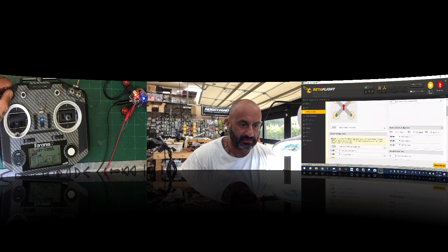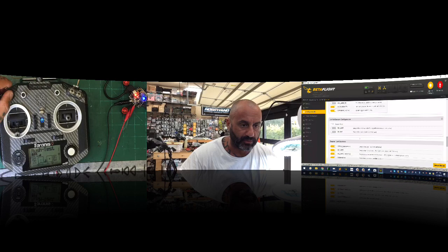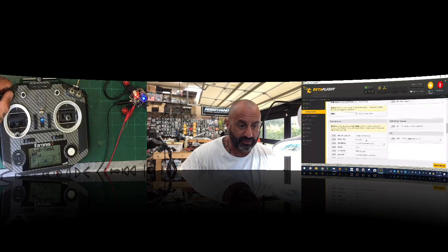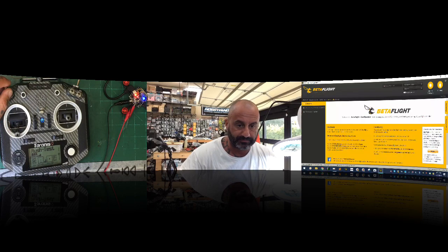Go back to configuration. And we'll just set the board. Now, the rest of this is going to be board-based, so I'm not going to really worry about it right now. I do not want anti-gravity on, and I'm not going to use dynamic filter for right now. Everything else looks good. I don't think there's any other issues there that I need to worry about right now, so I'm going to go ahead and click save. And that's it. This thing would be ready to arm.